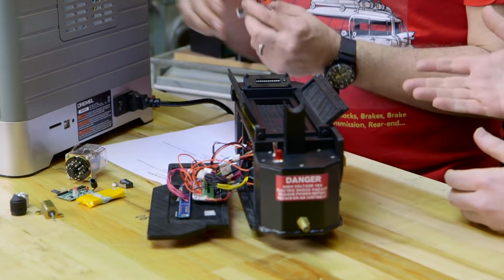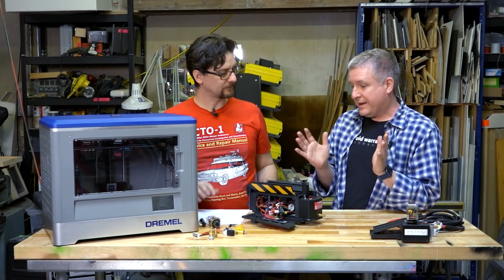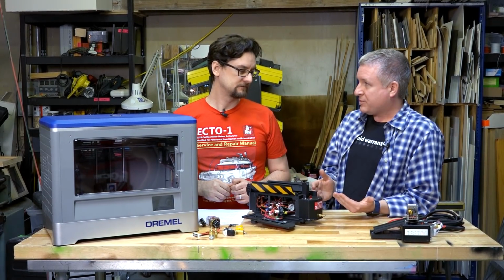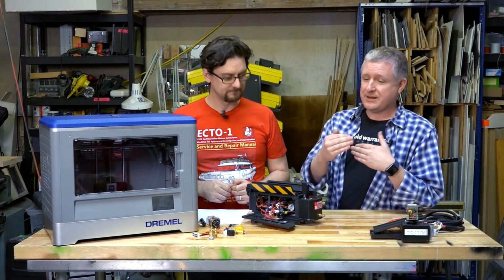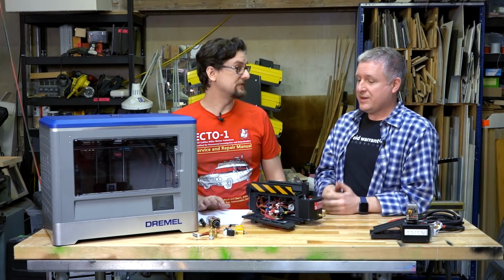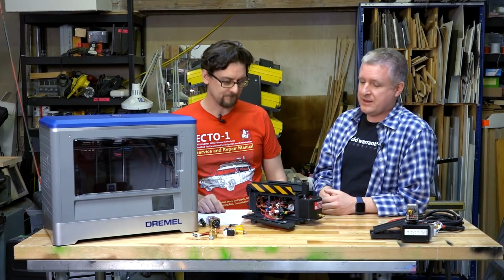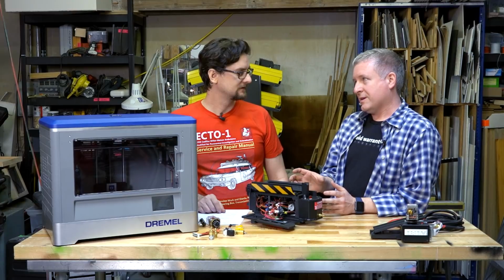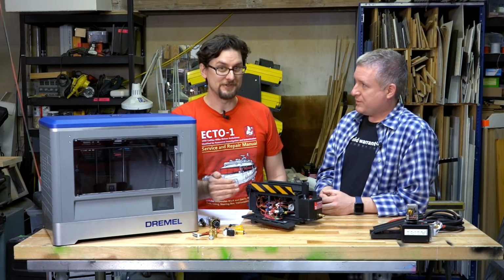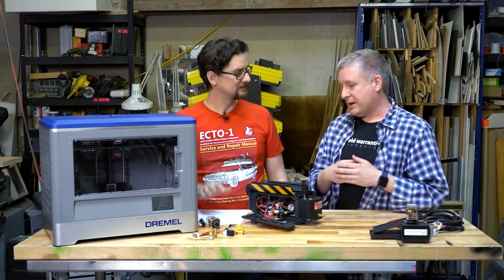Yeah. So you asked about the programming. It's really, really simple. It's just the trap goes through different phases or states, probably is a better word, where it has to know what sound file to play, and then it checks to see if that sound file is finished. If it is, then it enters a new state. With this soundboard, you can actually play sounds in the background while you do other operations. Which was really key for our setup, because that allows us to make the lightning sound effect while flashing lights. Which is something that you could only do with this music board for the Arduino. You wouldn't be able to do that natively. Because otherwise it'd be like, okay, you can play the light, then play the music, which would just take away from this. Yeah, so there's like 4 or 5 states it goes through.